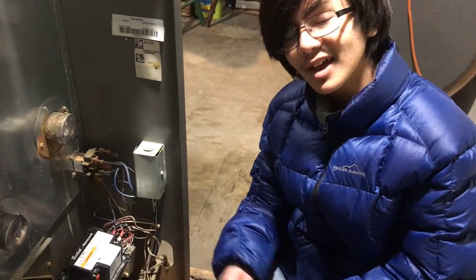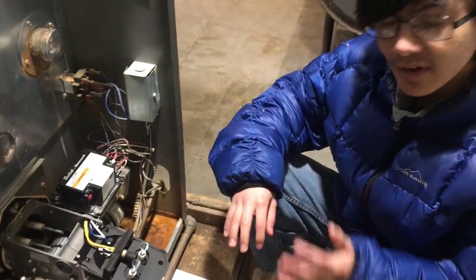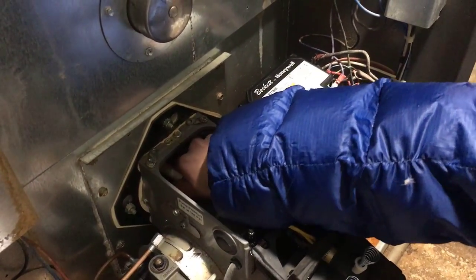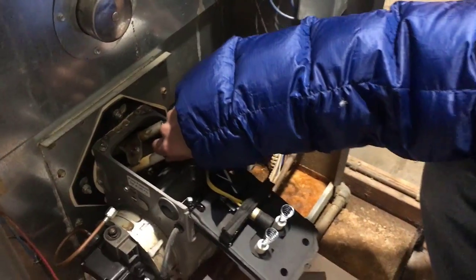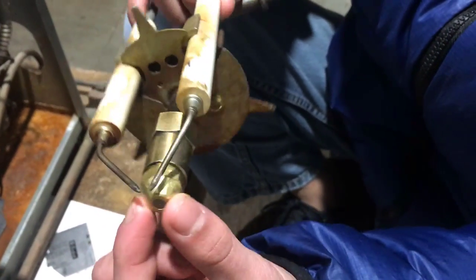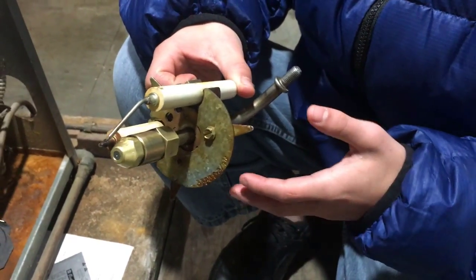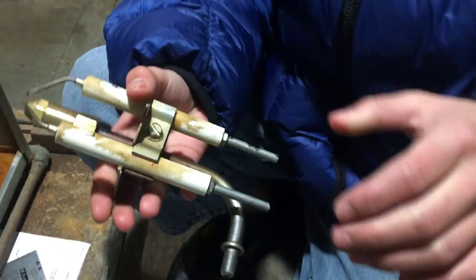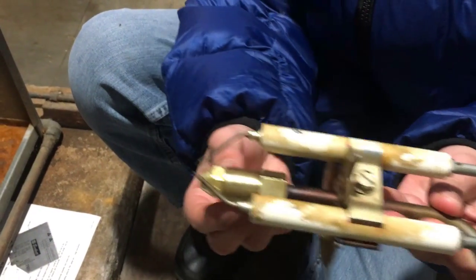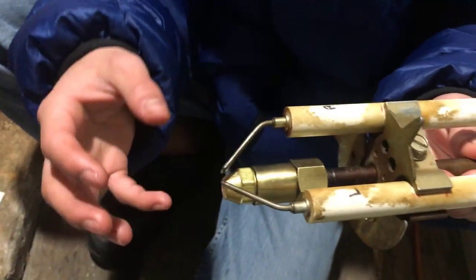This video is about diagnosing, not installation. After replacing the igniter there was still a spark, which means that although it might have been part of the problem it wasn't the main problem. So we directed our attention to the nozzle head, or spray head — this tiny little thing that looks like a hex nut with a cone. The oil goes through here and gets shot out the nozzle head. Then these two electrodes, marked L and R, shoot the spark — and as the oil goes out it ignites and fire comes out.